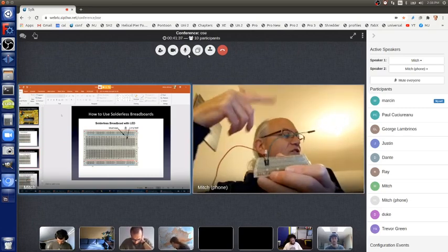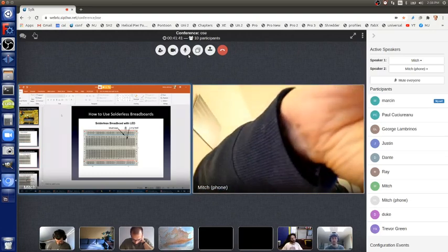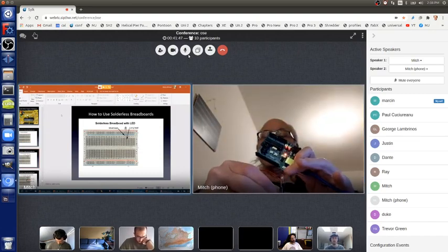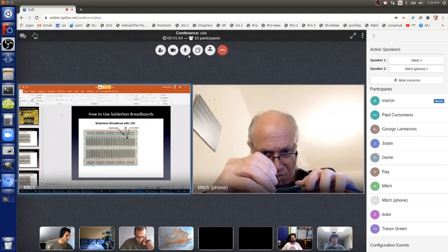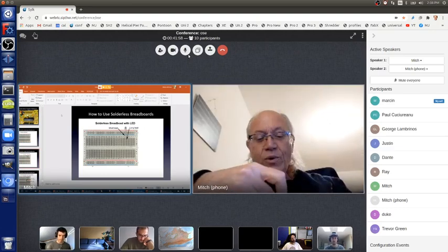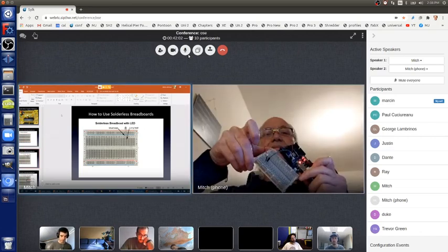So just like before, I can take my Arduino board. Before, I plugged the LED directly into the board in 13 and ground, but I can do the equivalent of this now. I'll plug the red wire into hole 13 here, and the black wire into ground, and check it out.